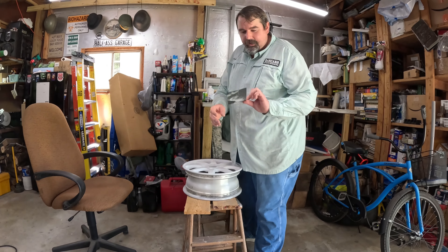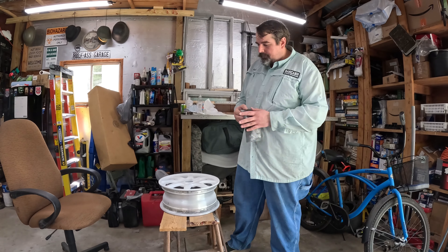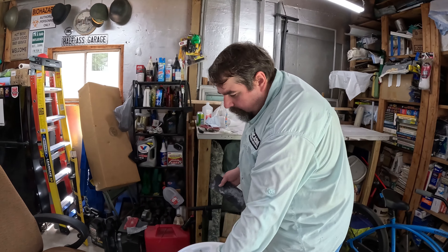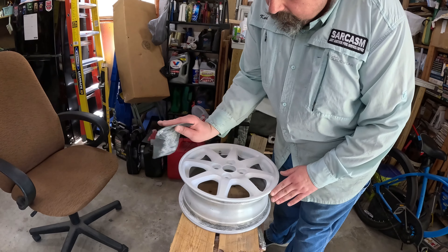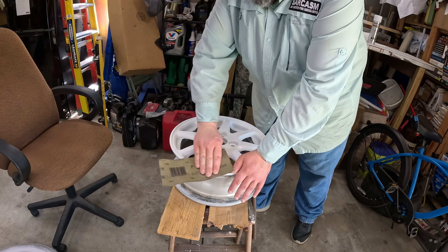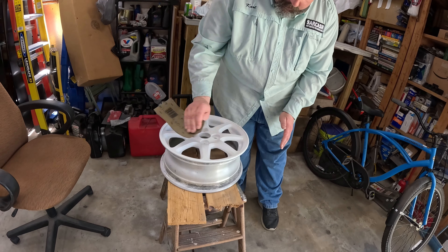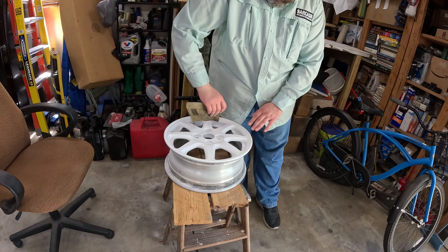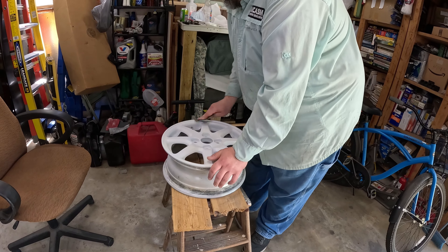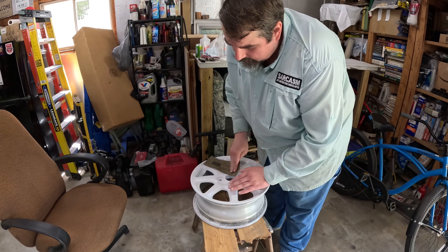Sometimes I've done this so long I don't think about it. I decided to give them a light sand — this is 1000 grit. You could do this wet; traditionally you would do this wet, but I'm just doing a light sand so the new coat of paint going over the top will grip better, and maybe it'll get rid of the flat appearance. It really is a light sand — it just kind of roughs up the top so stuff will stick to it and knock down some of the raised areas.